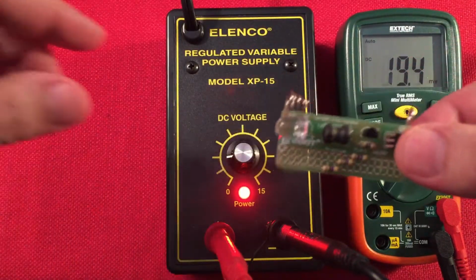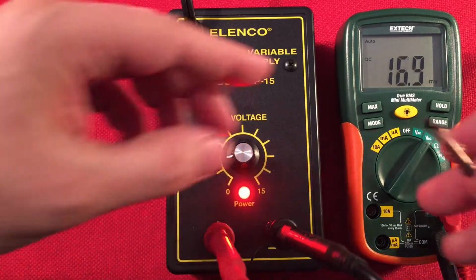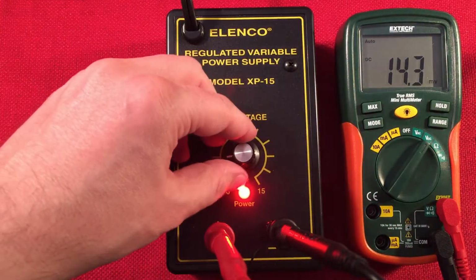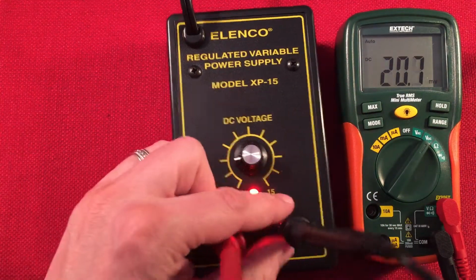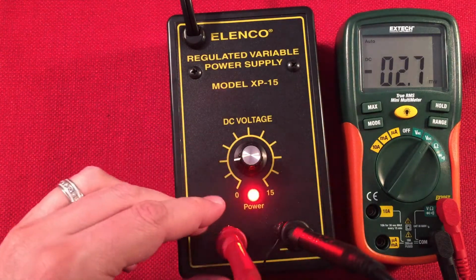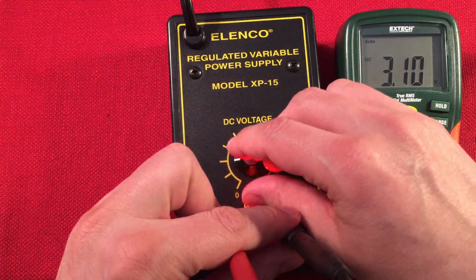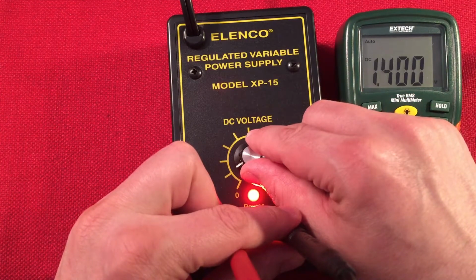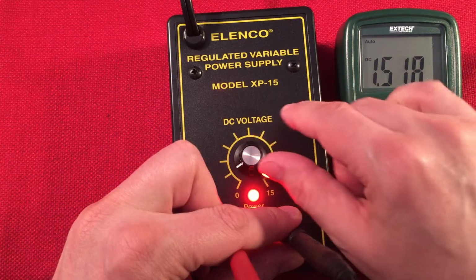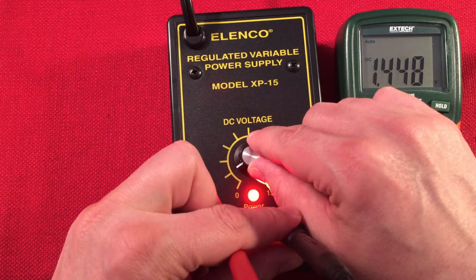So we'll take this out, and we're going to adjust down to the right voltage. So let's go ahead and see if it recovered on my voltage here. I like to do this, clip one of these wires so it doesn't touch. So let's see if we can get this recovered here. Okay, I'm just bumping these probes. Okay, so what we want to do, so I want to get the reading down to 1.5 volts. So let's bring it down. Okay, it starts getting more sensitive there on this scale. Okay, so we're about 1.5. Let's then get it closer. I'm barely moving this potentiometer, by the way.